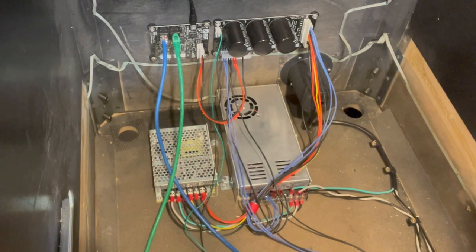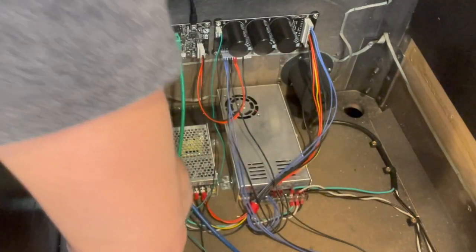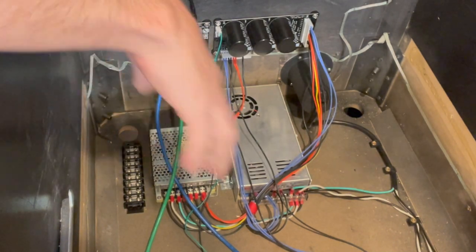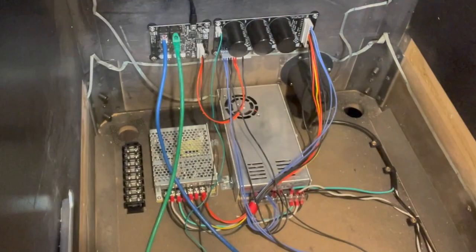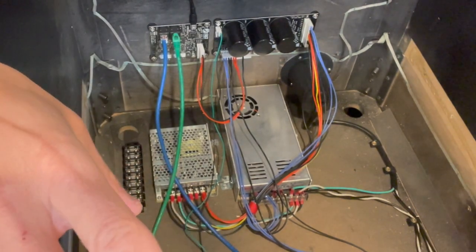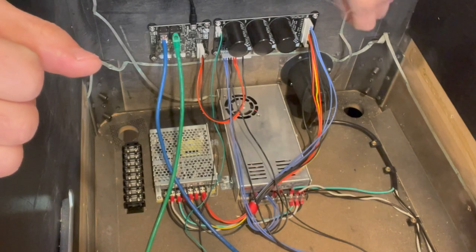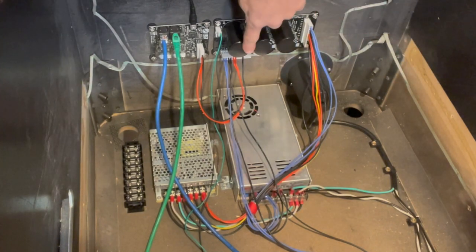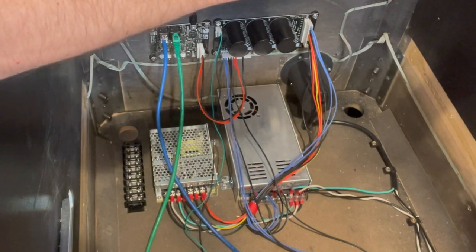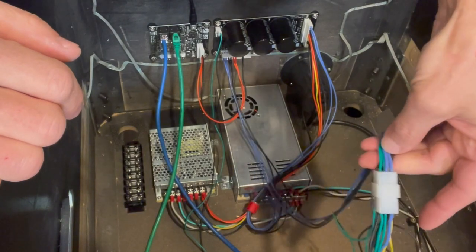So what we're going to do is, instead of having the power wire running straight from the power filter board into the nano board, we need to have it run to the terminal where we can split it — some going to the play field to the opto controller boards, and also coming back to this board as well. Not just dead-ending. I'm really trying to limit what goes to the play field to only what really needs to go there, so taking the play field in and out requires as few disconnects and reconnects as possible. We're going to have power coming from the power filter board down to the terminal block, then back up to the nano board, and also from the terminal block out to the play field where needed. No extra connections.